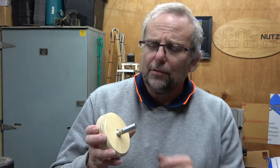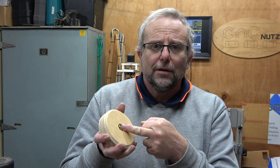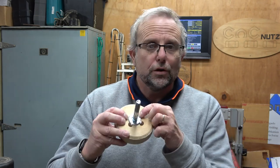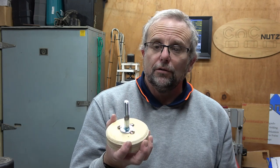Okay, a slight problem. Remember that old saying, measure twice and then just do whatever you want anyway? Well, it causes problems. So I designed this foot here with a hexagonal pocket in it, so that it could take the head of the bolt like so. I then put a washer on it, and some screws around the outside edge, and that would give me a nice solid foot. And I can just screw it in, adjust the height that I want.